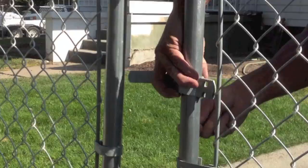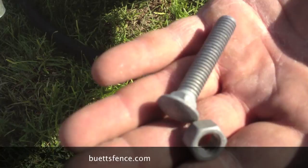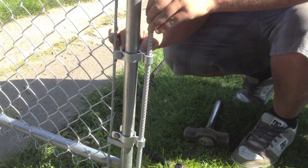For this fence project there are two different grades, so the ground changes level and it's not 100% straight — it'll stair step a little bit. For a double gate you also need a center drop rod, so we are applying females. That one will attach about 4 inches up from the bottom. Apply your drop rod and you'll want about 4 inches of slack to drop into the drop pin we're going to set.